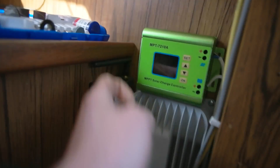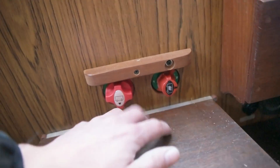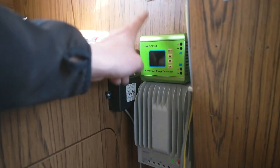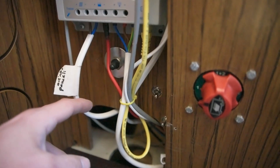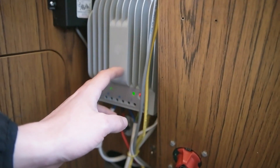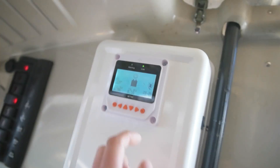This one is for 48 volts. I've got my four batteries under there, configured in 48 volts. These are those magic switches for them. Because I cannot charge them when they are in 48 volts since these only do 24 volts, I bought this during the winter. Yesterday I got it attached here and made this switch which routes the wire coming from the panels so I can determine which controller gets the power from the panels. Right now it's in here — you can see the blinking lights — and the battery is full.